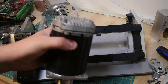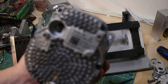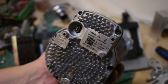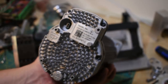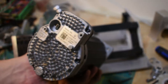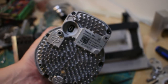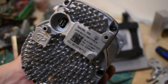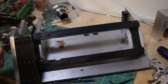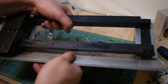Here's the spindle motor, also a Clearpath motor. At the time, this is one of the more powerful motors they ever made. They've since expanded into full horsepower size motors, like I think they do 56 and up frame, 56 frame, 134 frame. They look pretty sweet. It's really tempting to use one of those, but they're also huge, so I don't know, we'll see. That spindle motor is about, I think, 1 horsepower peak, so respectable. Certainly for the size, respectable.